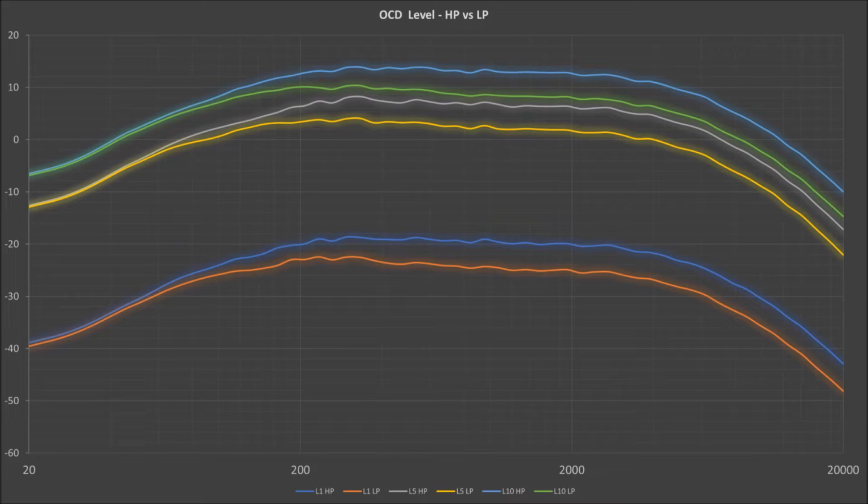This comes into a later part of the tone stack. It enables another resistor in parallel. Pretty simple trick, but it does have a pretty profound overall sonic effect. So I've seen a lot of people that just swear by one of these positions. I highly encourage that if you pick up one of these pedals, try both of them out, because I've found, depending on the amplifier, one can be useless and the other one can be magic.